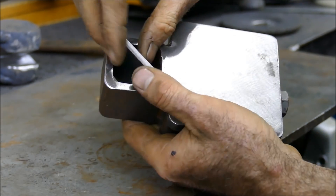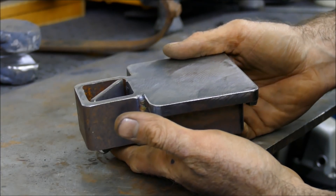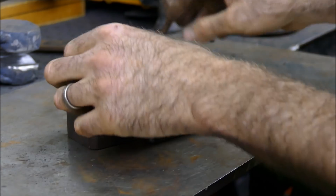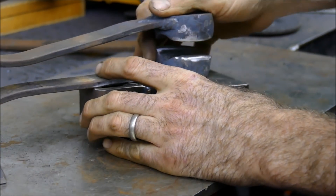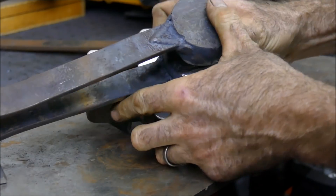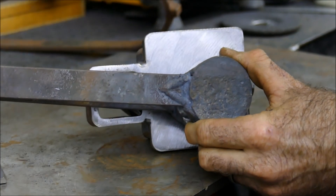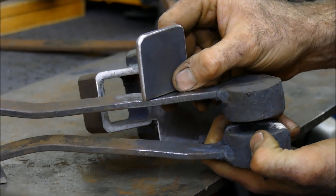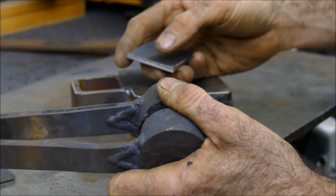You can't twist it so easily, and it's a very simple shape - you just chop them and stick them on, and you can turn the tools around either way. I've done this before on my old power hammer and it's worked a treat. Basically, that's going to get welded now to the underside of the tool so I can hold this in position roughly to where I want it on the power hammer, put two tacks across there. Pull the tool out, it will be attached, then I can zip a weld across the sides - nice and strong enough for what we need. I'll do that with both of these tools and then we'll start forging some acorns.